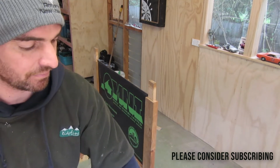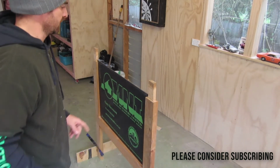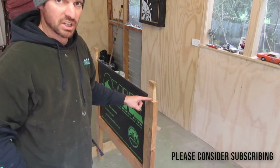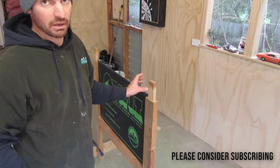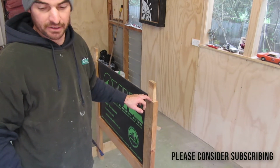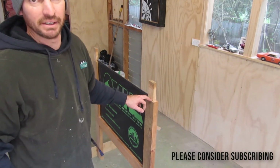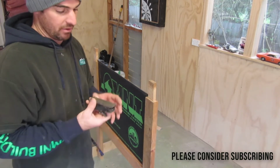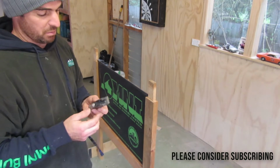But you just drill it, chisel it. A little bit more work. Do the majority of the work on the table saw, as you've probably seen in other videos that some people do. Then you use what's called a shoulder plane or a rebate plane. They're not a typical plane. They actually have the blade on the very outside edge, so you've got to be a bit careful.